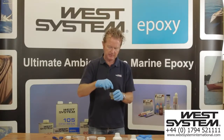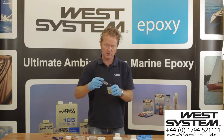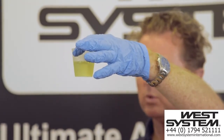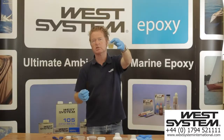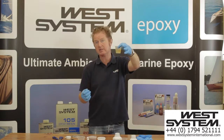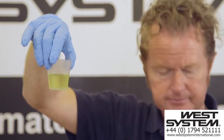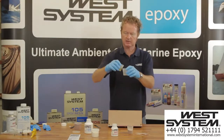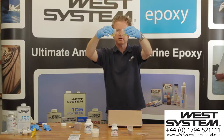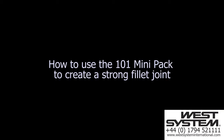Now I've mixed this up, and a really good question to ask is, how long will I have before this starts curing? Well, actually this amount will start to gel, which is the onset of the full cure, in about 15 to 20 minutes at about 20 to 22 degrees C. Now you can extend that working time by decanting the volume into another pot and creating 2 smaller volumes. A really good way of extending your working time by about 5 or 10 minutes.